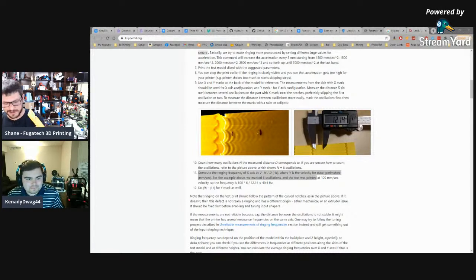I know we're doing this right after you got Klipper tuned, but normally in my build process of a printer, I get the printer built, I get some test prints on it, I get pressure advance tuned, and input shaper is the last thing I do, when I know that I'm not going to touch the printer again. Well, this is still a good learning point. Now you know how to do it in the future, and it's really easy to do after your first time. So 90 times 6, we're getting 540, and we're going to divide that by 18.36. That is 29.41.